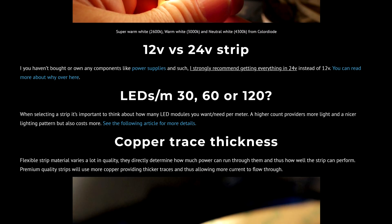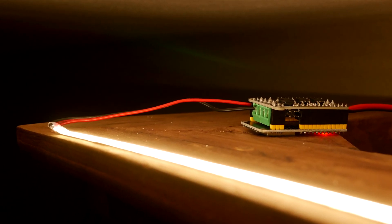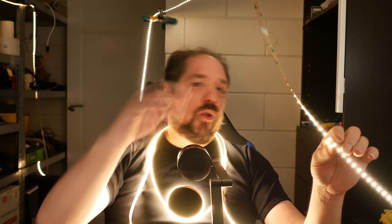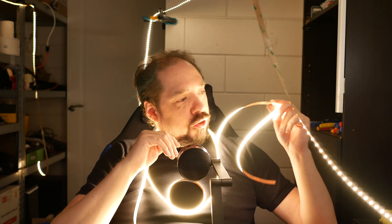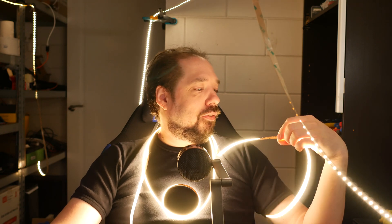I'll be adding this strip on quinled.info, where you can find all kinds of information about the strips I like to use, controllers, and so on. Here's a shot of how I used it in real life on top of a bookcase — the spacing from the LED strip to the ceiling is very short and I didn't want hot spots. For something like Color Diode strip I really recommend aluminum profiles for cooling, and with a milky diffuser cover you get good diffusion after about 10–15 centimeters anyway. But for certain projects where you can't add diffusion, this COB strip is a very different and useful option.